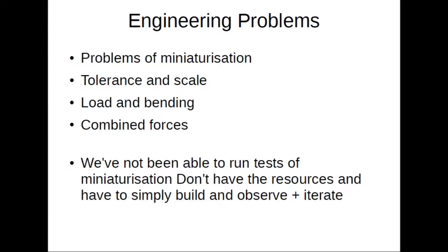Another approach we've made is testing a new idea on one braille cell with six pins. But when you increase that area to 40 cells — about 300 millimeters — the force of resting a finger on the middle of a bar that's only three millimeters thick is significant. Not only does it distort under the pressure of reading, but any machine moving on this support rail underneath applies force along the whole length, and then it bends. In the prototypes we've ended up having to use ground carbide rods, which are prohibitively expensive for the final machine.